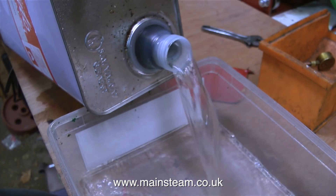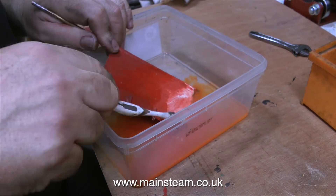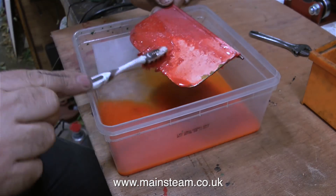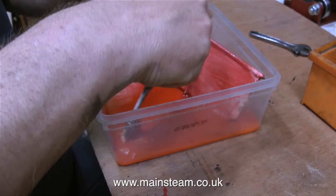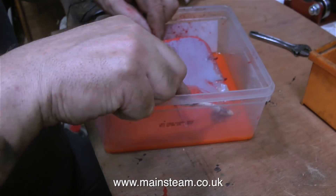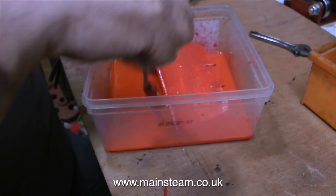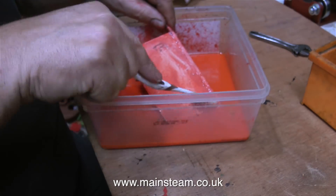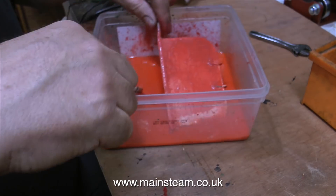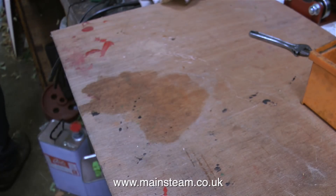This is a tin of premium thinner - apparently called lacquer thinner if you live in the USA. I'm using this to remove the paint from the rudder because it was badly chipped. I don't need to use premium thinner, but standard thinner smells really horrible, so I generally try and buy the premium stuff - it smells a bit nicer. In case any viewers write in starting with the immortal words 'are you aware that...' - yes, I am. I did the job, I videoed the job, I digitally edited the job, now I'm voicing it over, so any problems I do see. In this case, I'm quite aware that the shaft of the rudder is bent. The boat was built like that, and bent it's going to stay - that's the way the builder got the rudder to line up with the actual hole in the main boat and the keel extension underneath it.